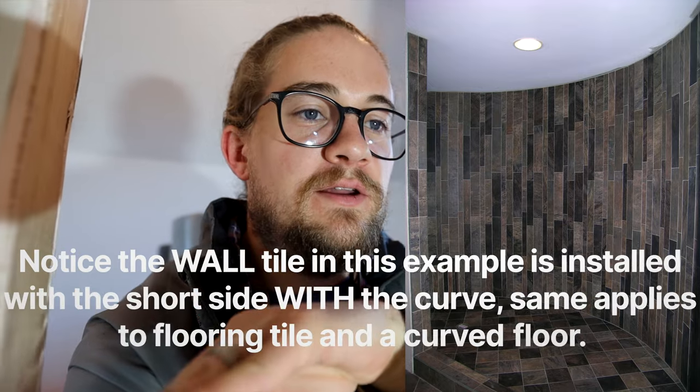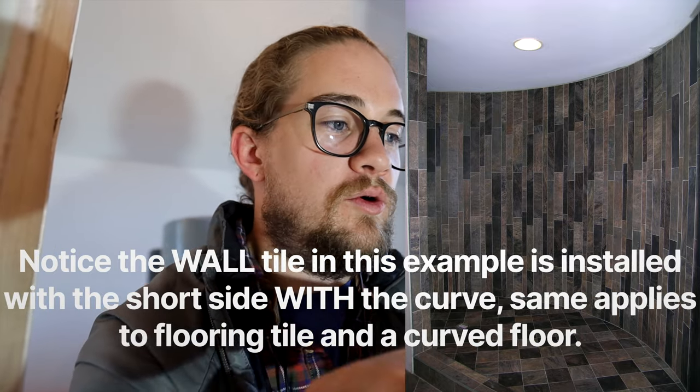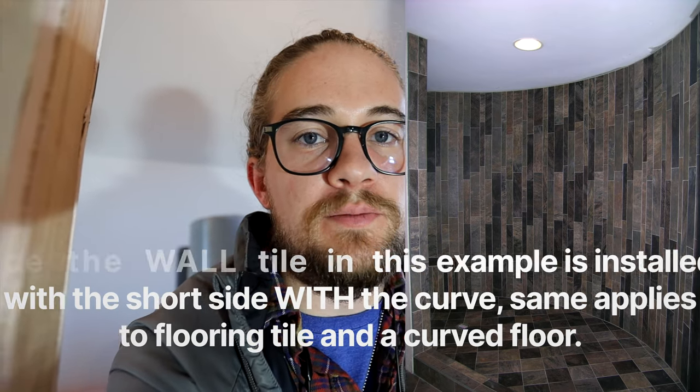If you don't have a level floor and it's cresting one way as you go through the room, and you're doing large-format tile, it's probably a good idea to pick something smaller. But if you want large format, put the short direction of the tile so it goes with the arch of the floor. That way the whole tile system can accommodate the slight bow, and you won't get a bunch of lipping on the tile. I ran the tile in the direction it's cupped — the smaller distance can compensate for a curved surface easier than the long distance.